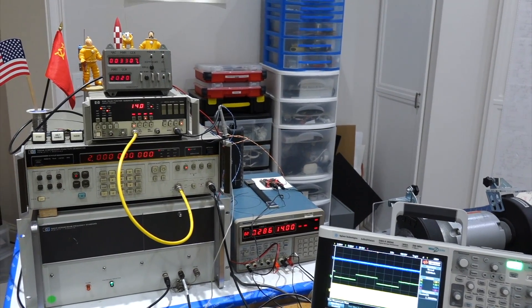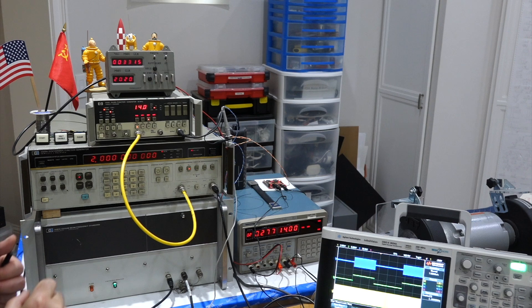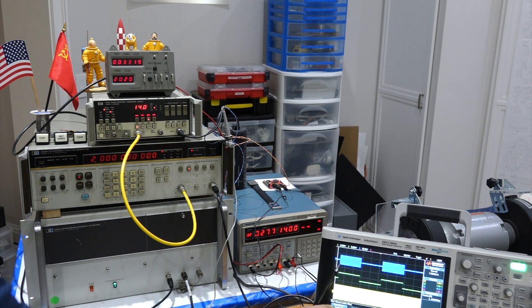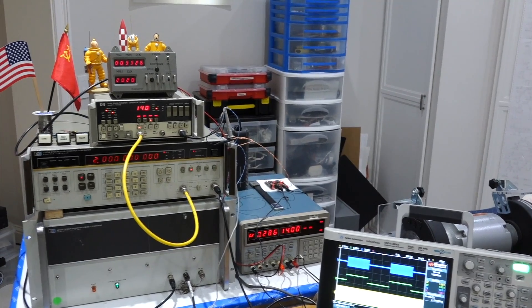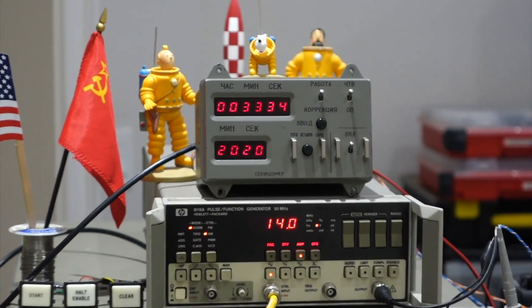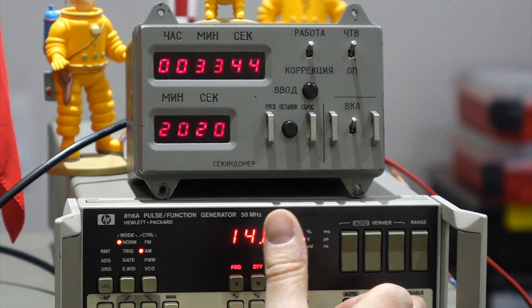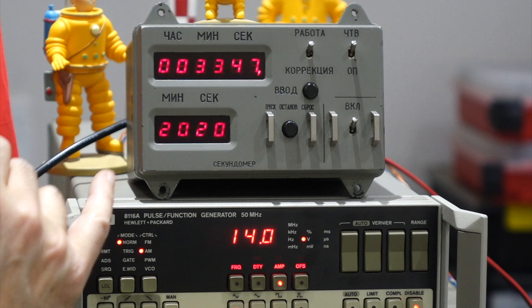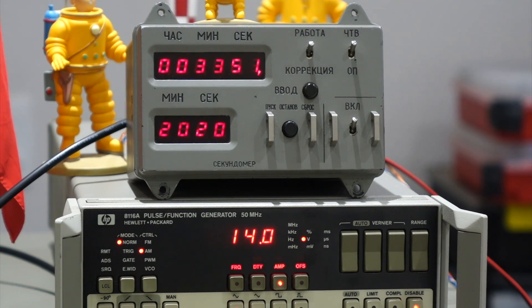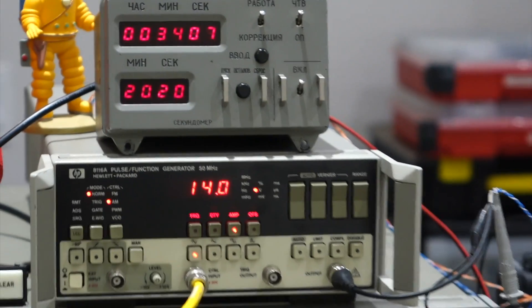I'm going to flip the magic button, and you're going to see the 800 Hz modulation come through, and the comma should disappear. 3, 2, 1, 0 — atomic time. You see the burst of 800 Hz, which is what the Soyuz spacecraft was producing and feeding to the clock. And now if we look at our clock, you'll notice that the comma has disappeared. Disabling the output and waiting a second — it comes back to the internal backup oscillator. And now re-enabling, it instantly locks back to the high-precision atomic time.